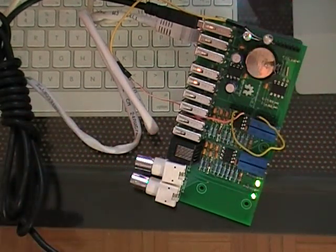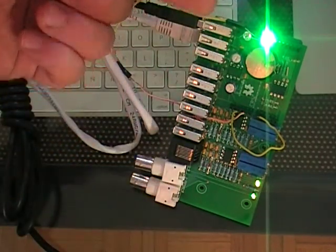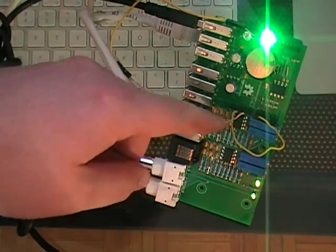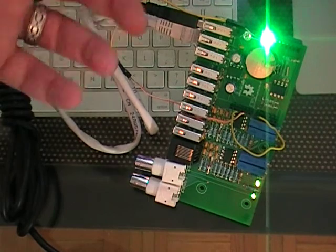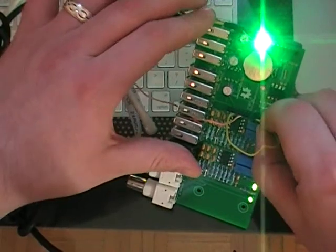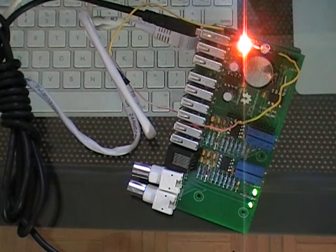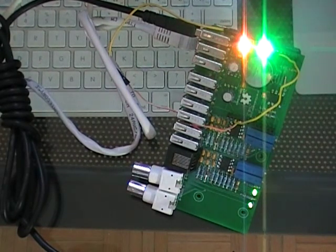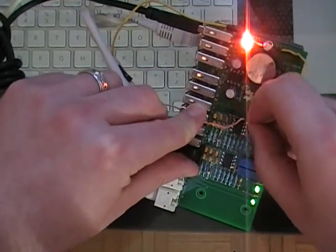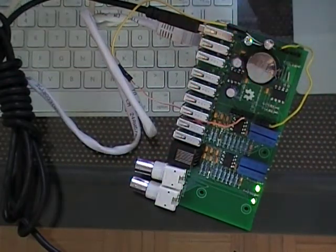And actually we have a conflicting measurement, because our temperature sensor is saying it's under 79 degrees, so turn off, but the analog macro is saying, well, it's above 500, so turn it on. So it's turning it on and then turning it back off as the macros run. So let's take this out and we'll put it in pin 5. So that's our macro for the digital. So we basically say, oh yeah, it's high, turn it on, low, turn it off. So we're all good.